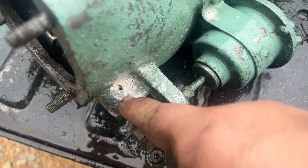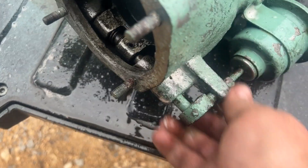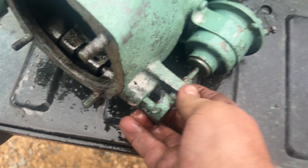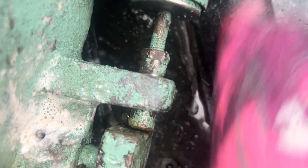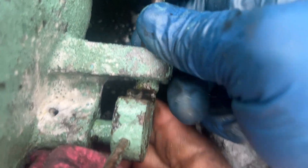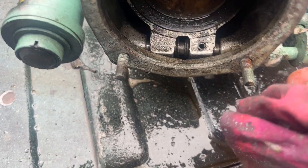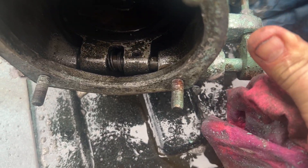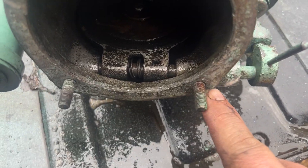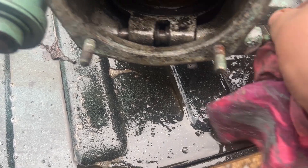We got this flapper freed up. They had drilled a hole through it and put a cotter pin through it to stop it. We got that out, but it was still seized up. It's a steel rod through an aluminum housing and it didn't like it — it must have been self-deploying. Sometimes this little catch here will vibrate out. Once that pin goes up a little bit higher, this slams shut and that cuts off the air to the engine. We put some heat on it with the MAP gas torch, kept using some liquid penetrant oil, and finally got it freed up — now it moves in there nicely.